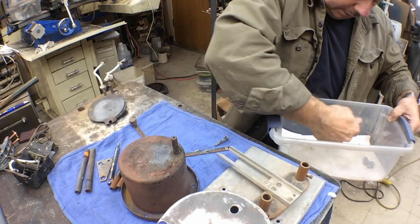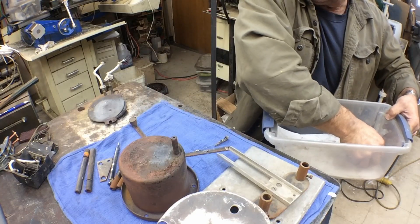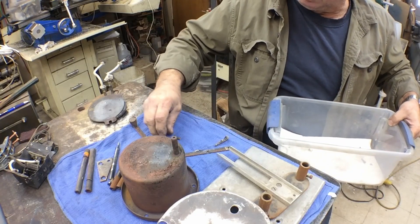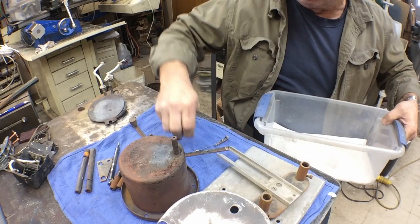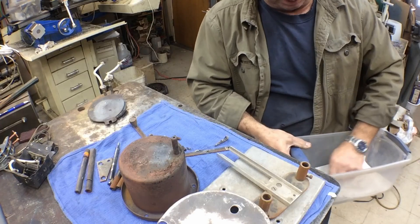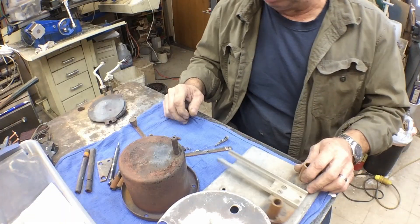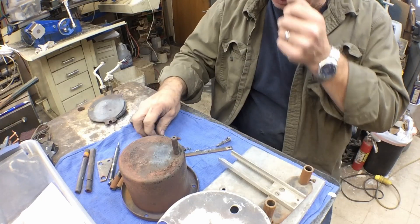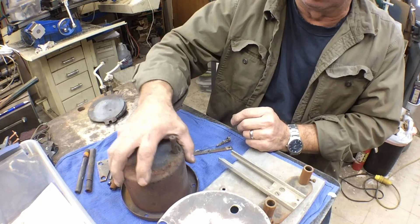As you've probably gathered, I'm a pretty big fan of PID controls on a lot of this equipment. I think for temperature controllers, for casting pots, all my lubricizers — I'm in the process of converting over what I haven't already done. In this day and age I think it's foolish not to do it. It's so inexpensive to control them that way, and it makes them kind of foolproof. You plug them in, let them go, and they do their thing.